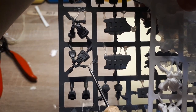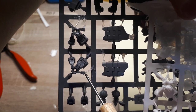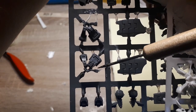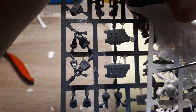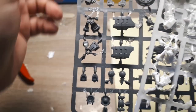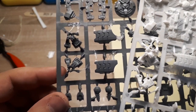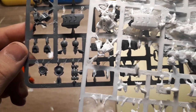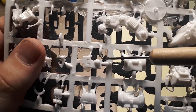Now, what's interesting is that with this foot, even though it's missing, it's got this big fat bubble in here, there is an air vent over here. So maybe the air got trapped right at the top. So maybe the air vent should have gone up and then to the side rather than from the side. But who knows? We will really find out if it's such a huge problem when we do a second pour, just to find how repeatable these results are and see if the parts that are missing here are also going to be missing in the second pour. Giant bubble of destruction right there.